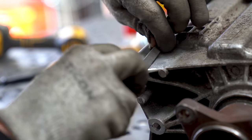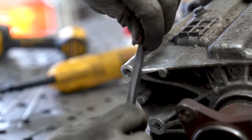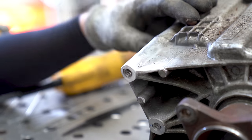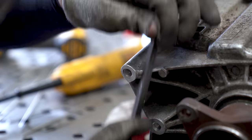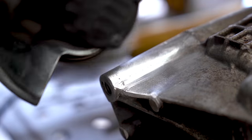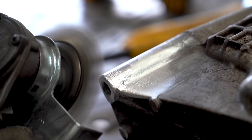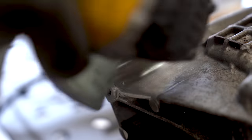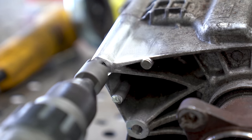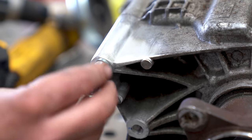The small file here knocks down all the ridges, all the sharp edges, and it allows me to get down deep into certain grooves where the flap disc wouldn't reach. Sandpaper then gets rid of all the marks from the file. I want to recondition this kind of like it was still cast, and I've found over the years that a very heavy knotted wire wheel — which most people have — will do the job. Press relatively hard until it really starts digging in, and you'll notice the pattern it leaves behind is kind of like a cast part again, just shiny. Then I'm going to chamfer out that hole to line it back up, and as soon as we test the bolt back in, we know we're good to go.